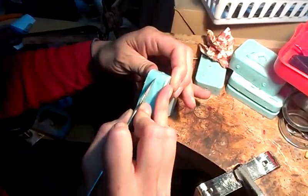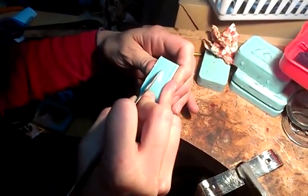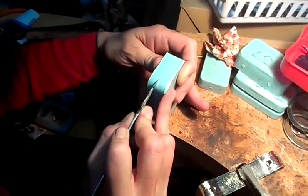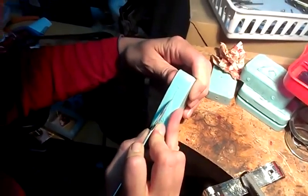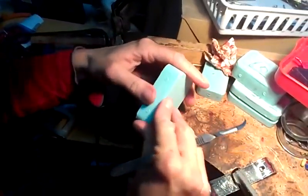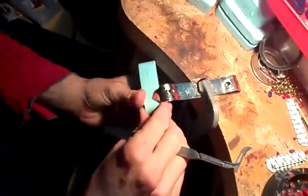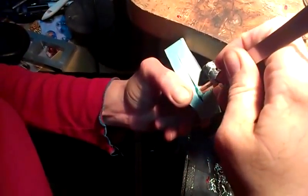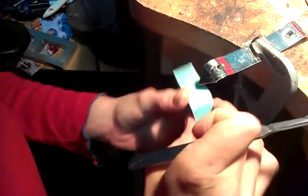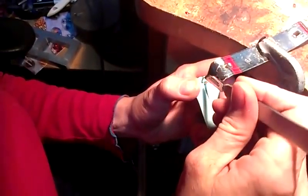Why 12? Because the 11 blade is a straight cut. This has a lot of control. It's a surgical blade. It's super weapony. This is kind of the dangerous part, because you're pointing at yourself. But as long as your pinky is on the mold, you almost cannot cut this hand anyway. So there's a protocol to how you handle the blade in relation to the mold to never cut yourself.